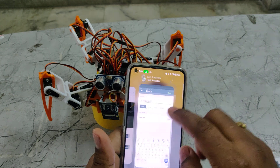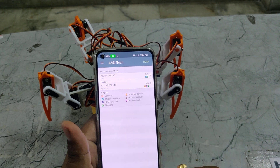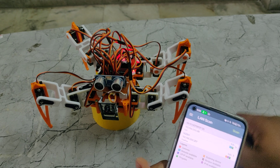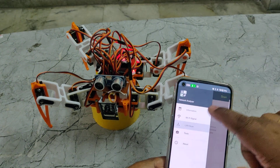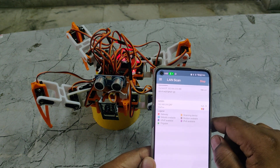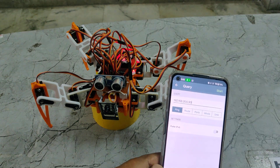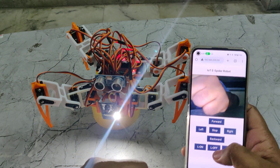From the Network Analyzer application we are going to get the IP address of our camera to control it. Once all settings are done, turn on the power supply. After initialization you will see one device connected on your mobile phone. Go to options, then LAN scan, and run the scan. There will be two IP addresses — one is your mobile phone and the other is the ESP32 camera. Click on the camera IP address and you will get the video streaming directly, along with light on and light off controls.